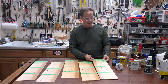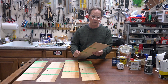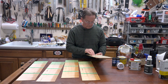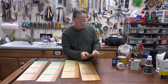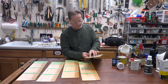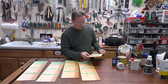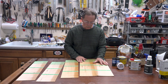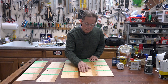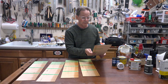Now the new kid on my block — the LED Vesting UV-cured hard wax oil — is hands down the best of the bunch. On the uncoated area, nothing from the water whatsoever, just a slight discoloration from the wine and whiskey. The wax section shows things more distinctly. But with the ceramic coating, absolutely nothing. So the two that fared the best are the oil varnish blend and the Vesting, especially when they had the ceramic coating on. Definitely the Vesting is the clear winner for the chemical tests.